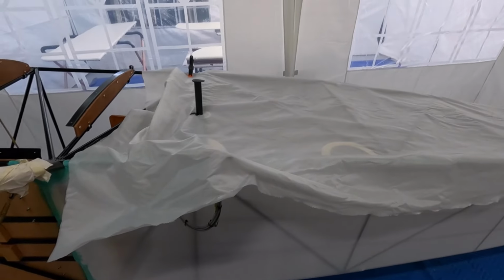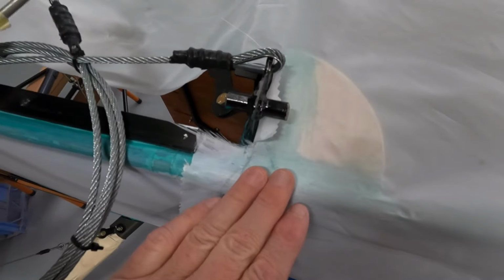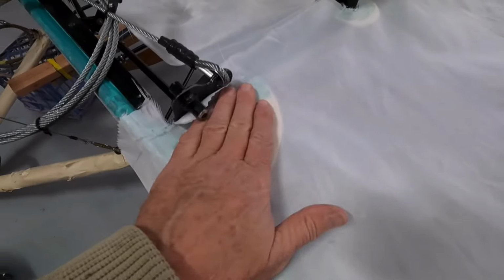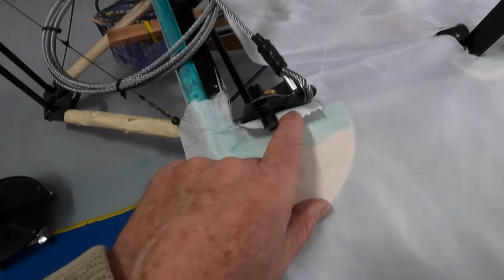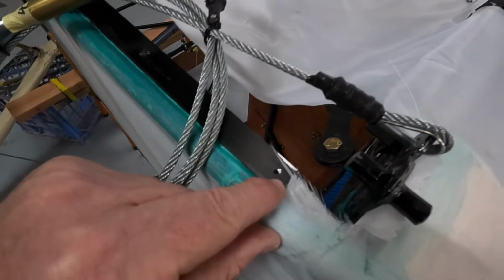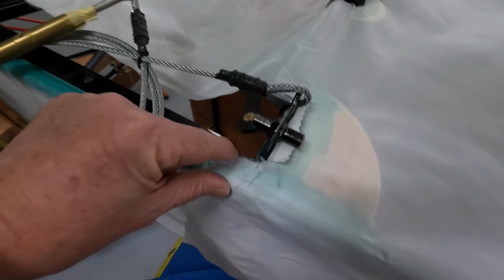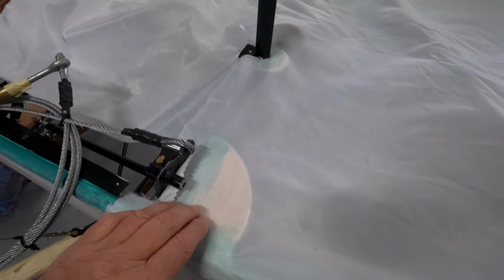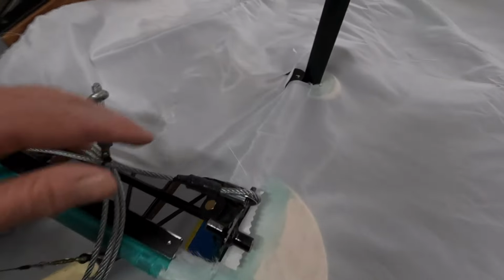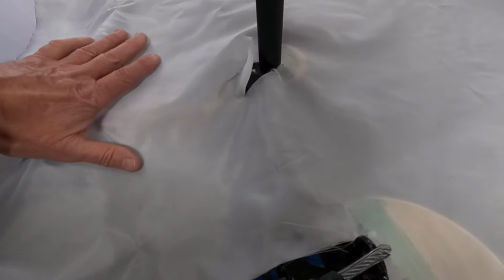All right, slow and steady. All right, going well. Got that tacked in nicely. Now, remember with these edges, I'm just going to wet that with glue. Then it's easier to handle, believe it or not. Same as this frayed edge here. That'll get a coat of glue, razor blade, and we'll tuck it in nicely. I'm just borrowing every bit of airframe I can to help adhere the fabric, because it's trying to pull that way when I shrink it down. This bit here will get trimmed off in a minute, and it's going to get tucked down and wrapped around the tube.